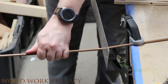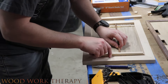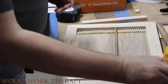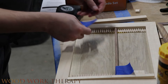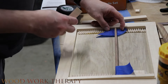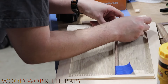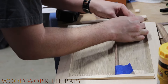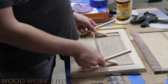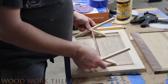This saw does not like these small pieces — probably should have used the trim saw. If you cut it correctly, those two little sides should fit perfectly on each side. Now we're going to glue on the feet. I'm putting some glue and painter's tape underneath the dowel, and this does two things: number one, it keeps the glue off the bottom, and number two, it keeps the little foot in place so it doesn't go flying around. We need to put a liberal amount of glue on there to make sure it stays. This gives you the general idea of how it looks when assembled — you can see these just kind of pop into place and hold on where they need to.